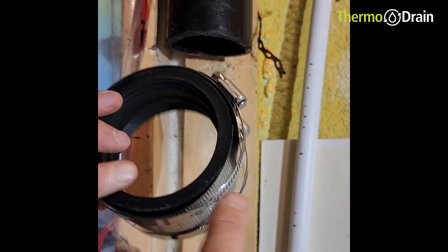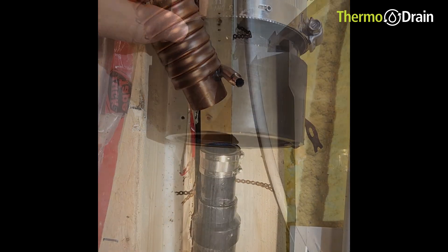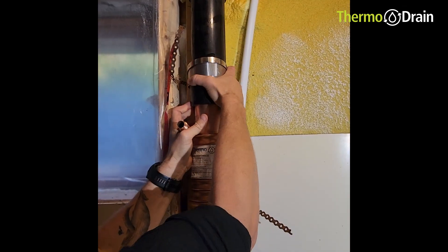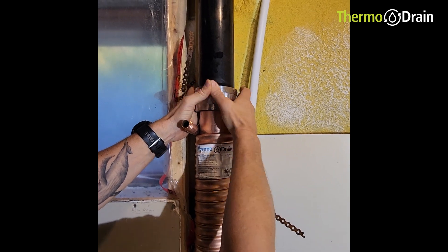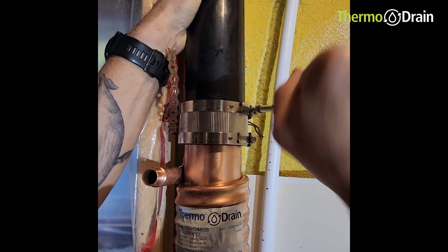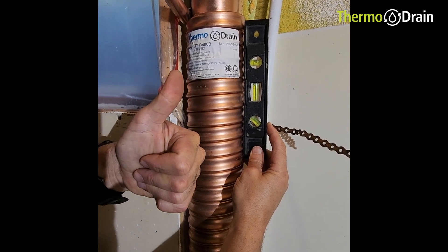Make sure you're putting the right side — the thin side can end up on there so you've got to be careful. Push it all the way up. Install the thermodrain at the bottom first, squeeze it in there, then put the top of the thermodrain in with the coupling. Slide the rigid coupling over and make sure the two bolt heads are facing out. Tighten them up snug, same with the bottom. Then verify that it is in fact vertical.